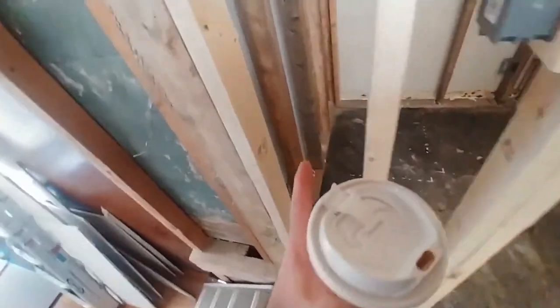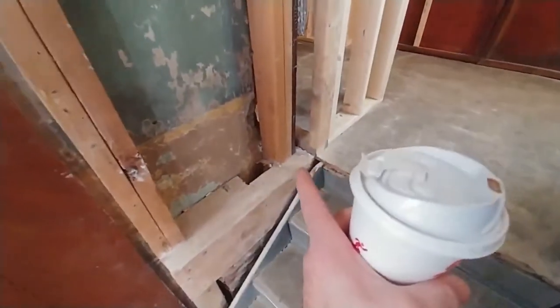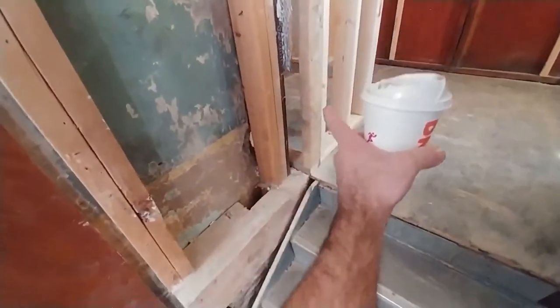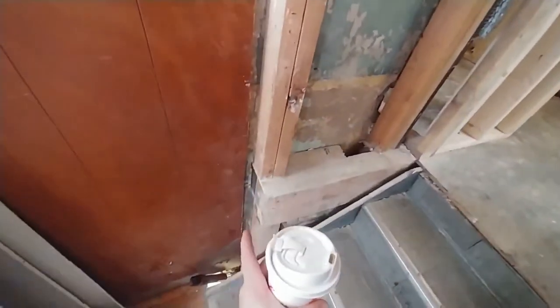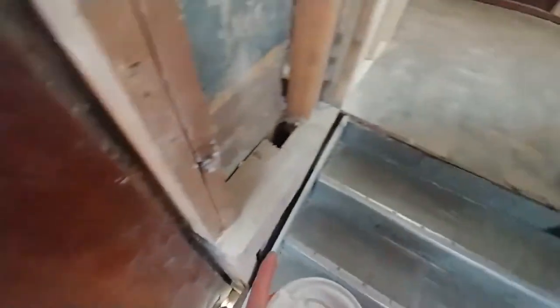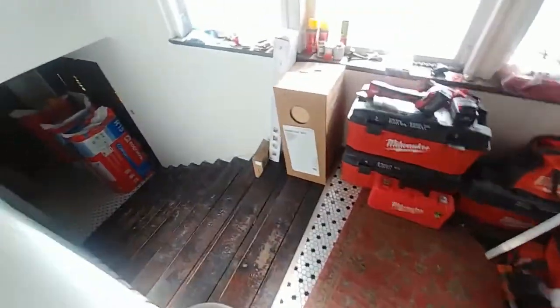But today I went along here and I went along here and we demoed this off, but I started seeing brick here, which is a problem. And I know this is in the headroom of the entryway downstairs. So I started to think, what if we came along the laundry room wall, came through here, rolled off the end of this brick, and went straight downstairs? So I put my light right there so I could get to that location down there. And I went and looked, carved this open. This was all metal lath and plasterboard. I had to use a diamond blade on the grinder.